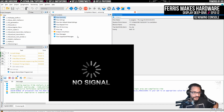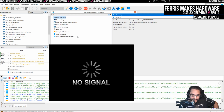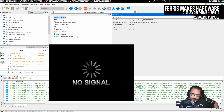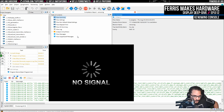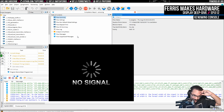Oh yeah, that's what you mean by those timing errors. Yeah, I do have the soft reset being driven, but I'm assuming that would be okay. And it's not. I think that's an output that's registered from somewhere else. Maybe not though. Yeah, it is really weird that there's so many of those errors.